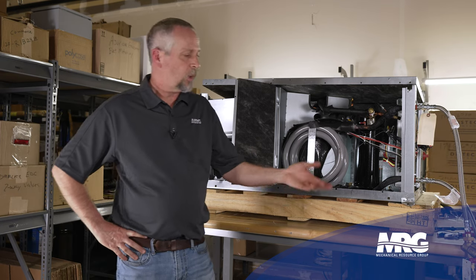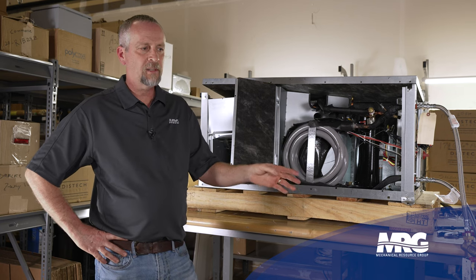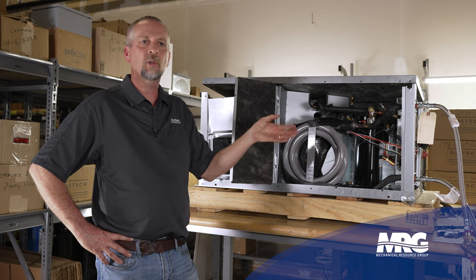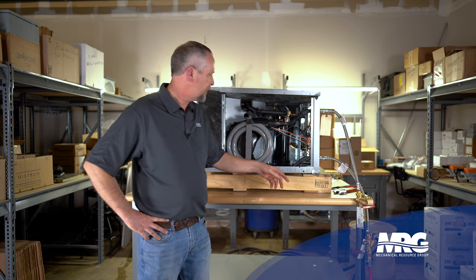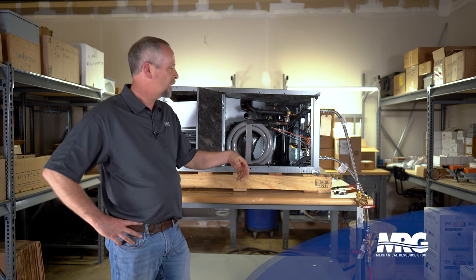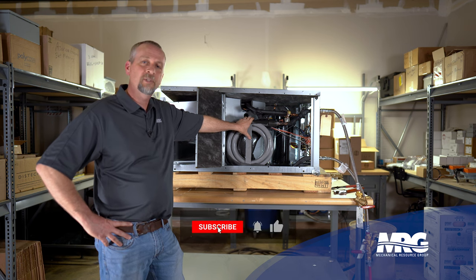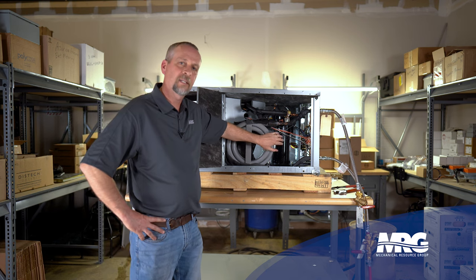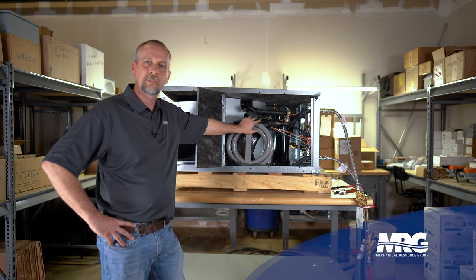So that's the basics on how to check a Y strainer, make sure it's clean, and also how to back flush this coil. Good practice: go ahead and clean the strainer, and if you've got the time and you've got something to catch the water in, go ahead and back flush this thing. It only takes a couple minutes, and then you can walk away feeling confident that the unit is clean and that fault code isn't going to come back. If we just clean the strainer and don't do that, we're taking a gamble that the customer is going to be happy. Thanks for watching everyone. Next video, we're going to talk about how to chemically clean this in case it's scaled and we just can't back flush it. Be sure to watch for that, and we'll see you next time on Mechanical Pros.